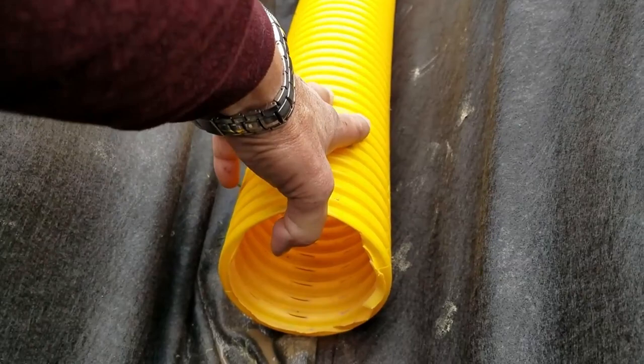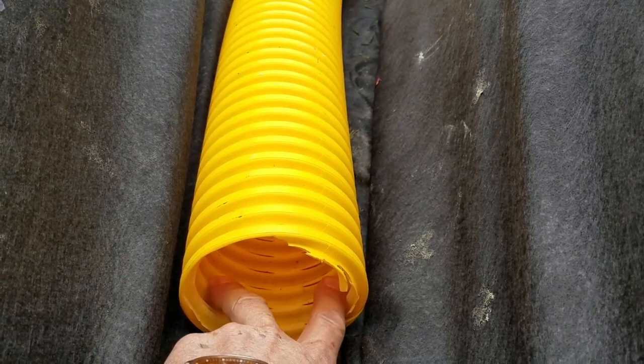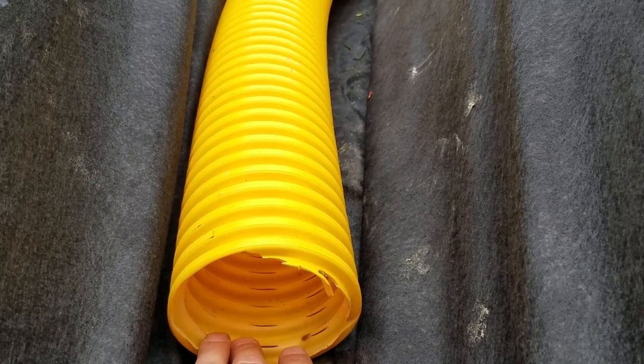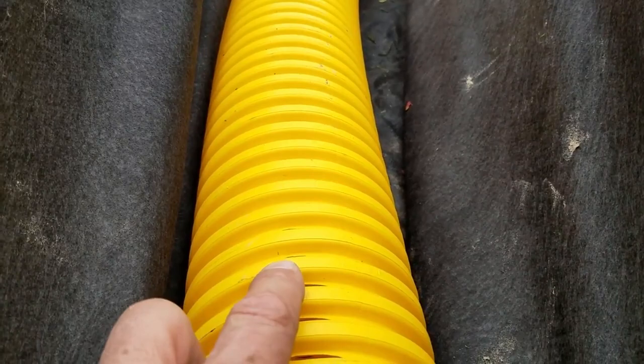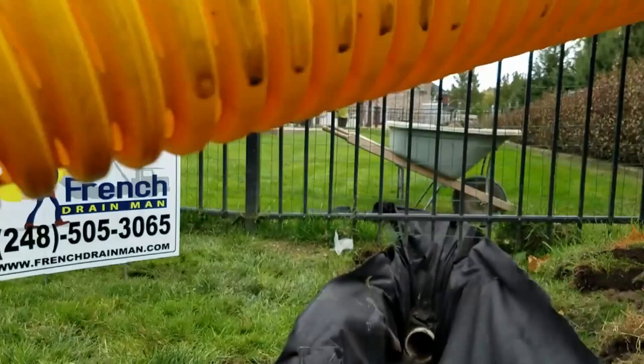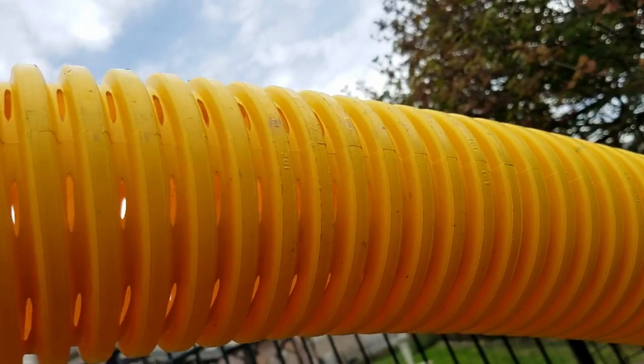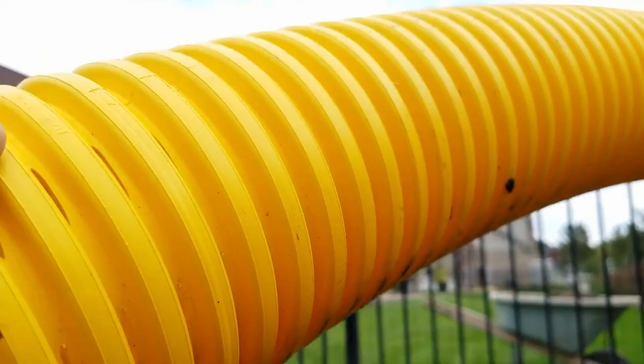We can get away with it for a couple of reasons. One, we're laying it on the fabric, so we're not laying it in the dirt. Two, this is not a pipe for building a septic field where you just have a couple of holes in a line at the bottom. That pipe is designed where you put stone down first, then put the pipe on it, then more stone after. We have a pipe that has eight slots per valley, so we have eight inlets going around the pipe. You can just see all the inlets. There's so much inlet for this pipe — it's mad crazy from the sides to the top — so laying it on the bottom does not affect its performance.